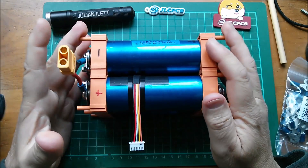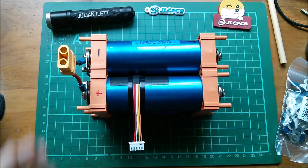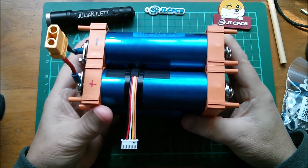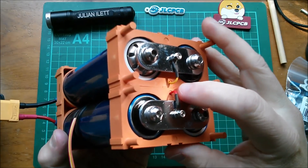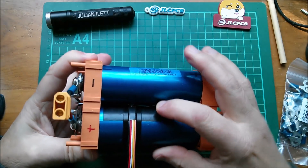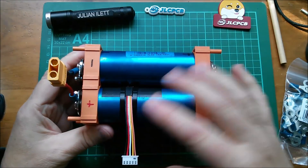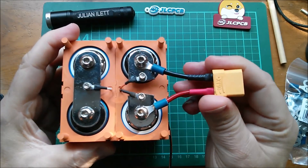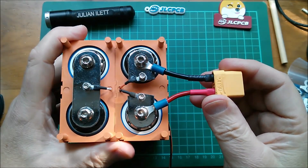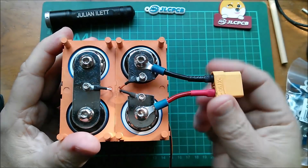Both of these items are for my bike battery rebuild - it's going to be a desktop battery for a few months and then go back into the bike. I've put the balance lead on this one - it's a five-way connector for four cells. I've got neat wires running through holes with black insulation tape and two black cable ties as strain relief for the balance charge lead. I've put XT90 connectors on my positive and negative terminals - I went for XT90 because it takes higher current than XT60, but also to remind me this is ultimately going to be 24 volts, not 12.